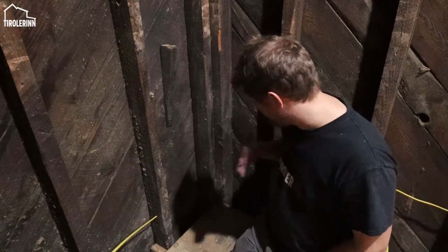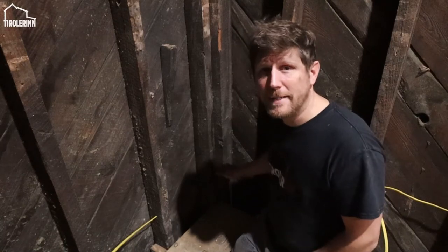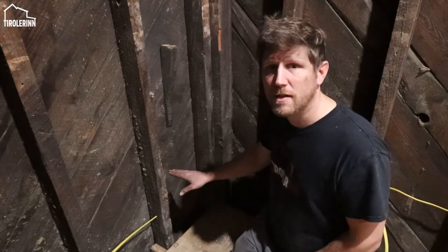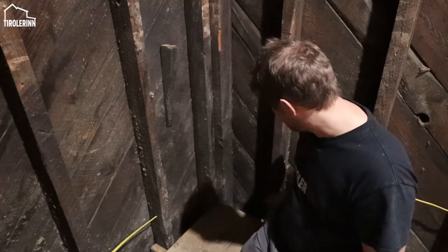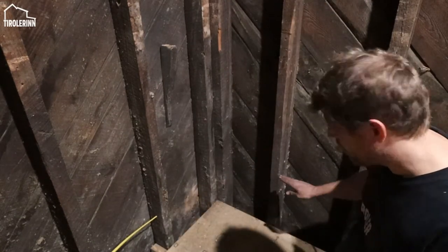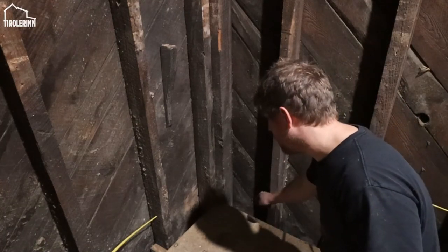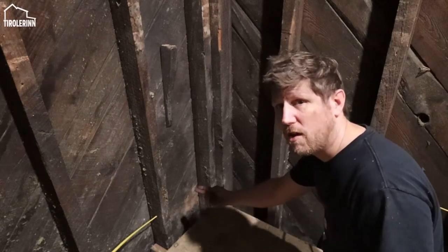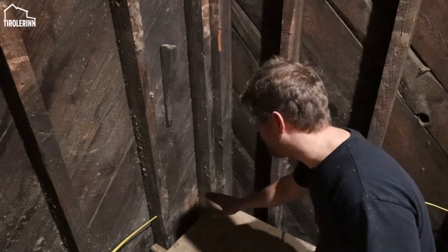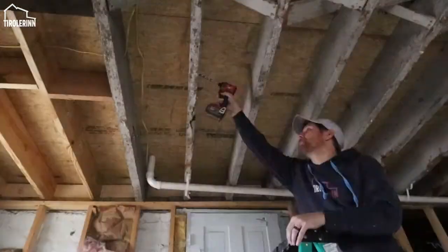So what I like to do is go into the floor below us, always with the wire, and use the joist area there, make holes in the joist, and come back up. It's very simple, uses a little bit more wire, but I think it's worth it. So basically I come over, go down in that area where I need to, make a hole in the joist from this side, make a hole in the fire plate that you have on here, and then come back up and continue my circuit that way.